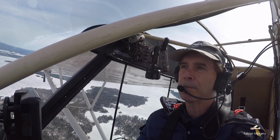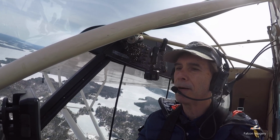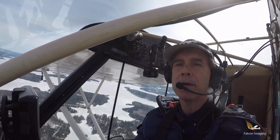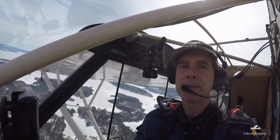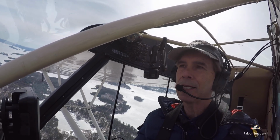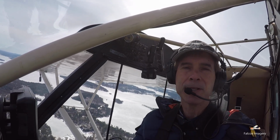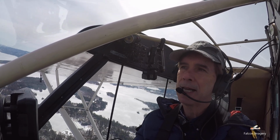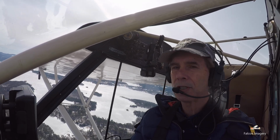I wound up reaching out to Piper, talking to an expert there that's got a lot of experience with Super Cubs, and basically he thought it was probably carb ice. He also had some other idea that it was possibly associated with icing in the fuel cap area, creating a vacuum in the fuel tank. If that had been the case, I would have had some type of deformation in the fuel tank, which I didn't have. So we chalked it up to carb icing.